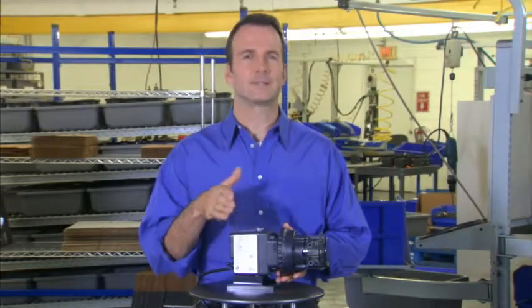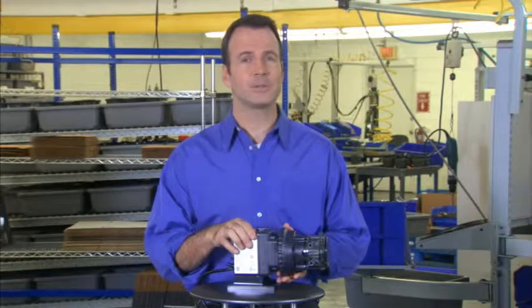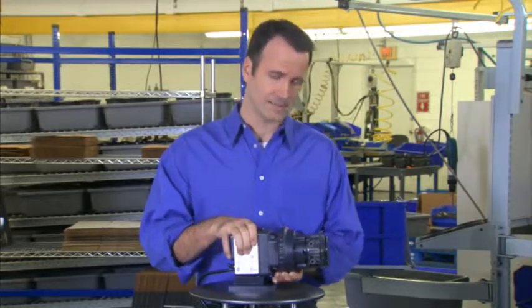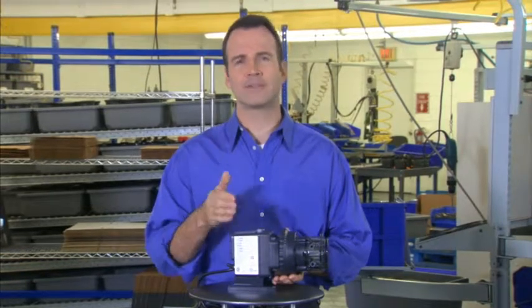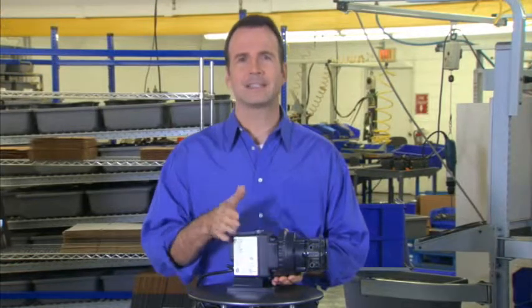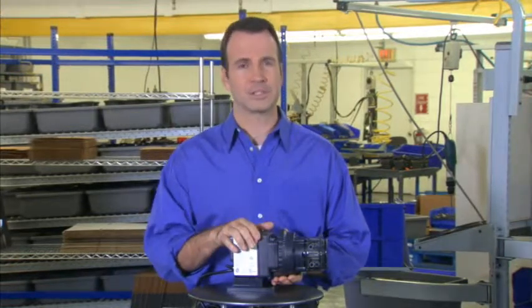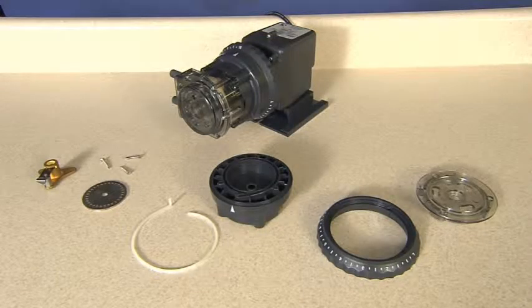The feed rate is a precision control that consists of mechanical parts that are subject to wear when the external dial ring is set at a lower setting. So the factory recommends selecting the pump model that is closest to the maximum output capacity within the requirements of the application. It is like the wear of brakes on a car, which is dependent on the operator's driving style. When the feed rate control makes a skipping or ratcheting sound, or the pump output is less than what the setting indicates it should be, one or more of the parts may be worn.